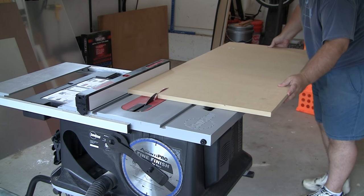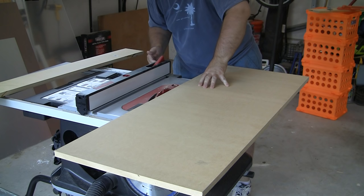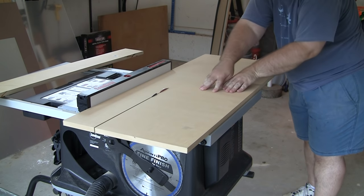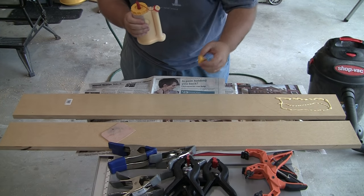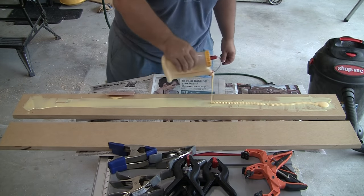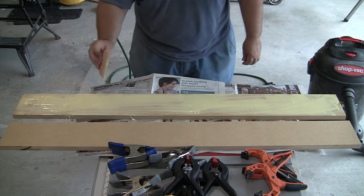For the sled fence, I'm going to use two three-quarter-inch MDF boards glued together to give me a 1½-inch fence — this should give it enough strength to stay flat for years to come. I ripped one piece at 5¼ inches and the second at 5 inches. This gives a ¼-inch overhang after glue-up, providing a nice straight side with no glue bleed-out to make it easier to rip your final size later. Remember Zombieland rule number 2 — double tap — meaning don't be cheap, use plenty of glue. It also doesn't hurt to remember rule 12: Bounty Paper Towels, for cleaning up all the glue bleed-out.